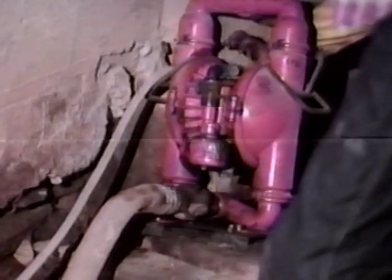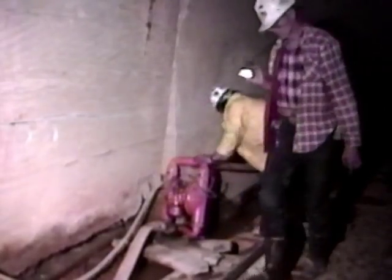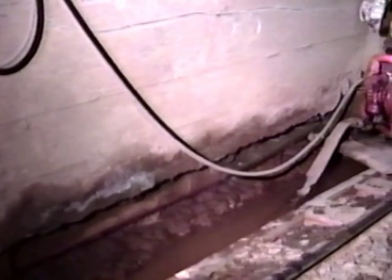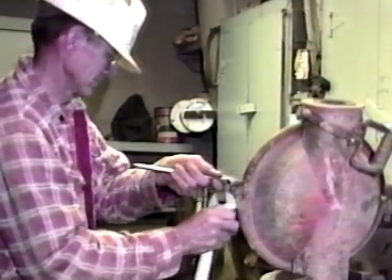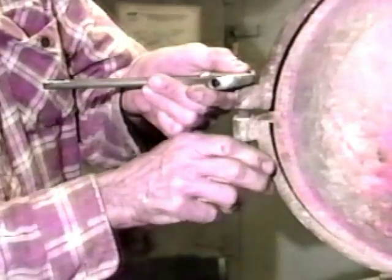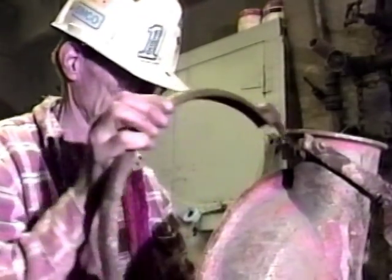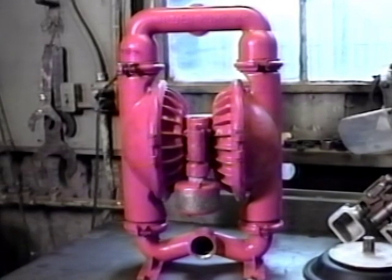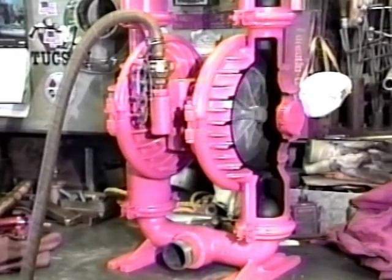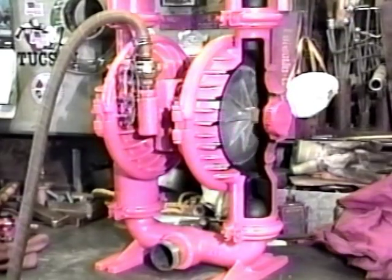You need a pump that is safe, simple to operate, and reliable. It must also be explosion-proof and have the ability to handle a wide range of slurries. Given our acidic underground water, stainless steel pumps have proven to be the most reliable and cost-effective. Your support people need a pump that is quick to troubleshoot and repair, contains a minimum number of parts, and is cost-efficient to operate. Based upon the application and operation criteria, the most suitable pump available is the air-operated double diaphragm pump.